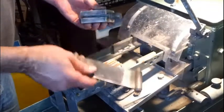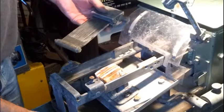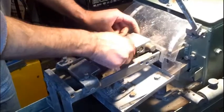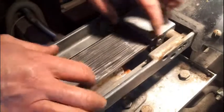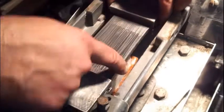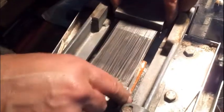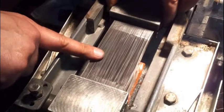So let's look at the way it goes together. The conversion block — the blade slides in there at this end and this end. It can only go in one way because this is where the locating bolt is at this end. What's important is that the blade is square. We can actually look as a guide to whether or not it's square. We don't want the blade sitting crooked because we're not going to get a straight cut. So it's important that we look down the blade and ensure that the blade is in fact covering the mother of pearl underneath.